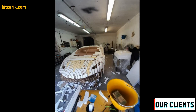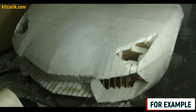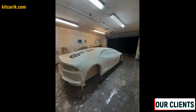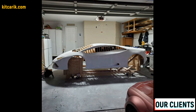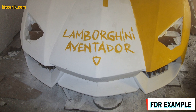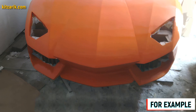After the foam dries, the excess foam needs to be cut — this can be easily done with any convenient tool along the ribs of the car buck sections. After foam cutting, the layout looks better. Next we need putty: gypsum mixed with water to the desired consistency, applied with a putty knife to the foam. We'll need to make a few thin layers, allowing each applied layer to dry and then removing all burrs with sandpaper.